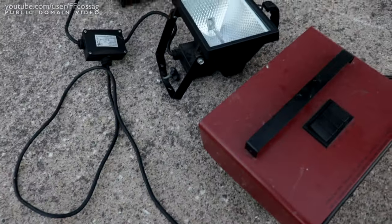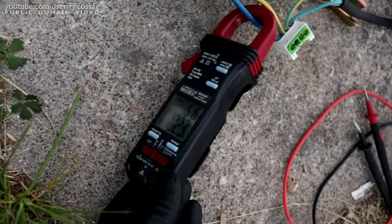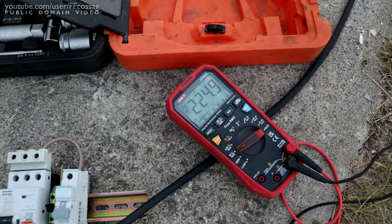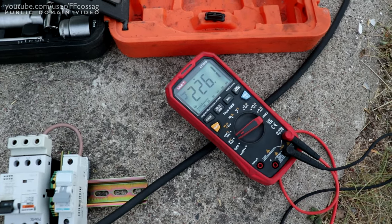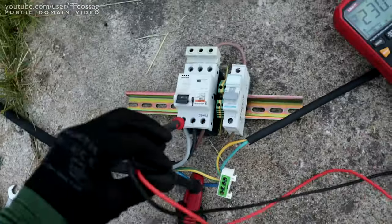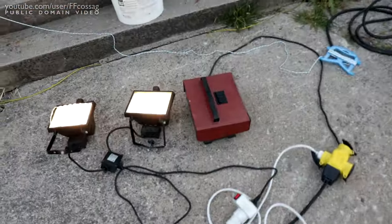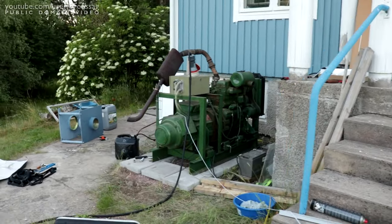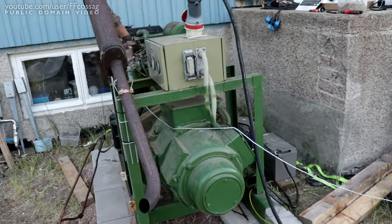Let's go all the way — lights and 2000 watts, uneven loading. We now have over 10A of load. Loaded phase: 225V. Unloaded phase: 226V. Third phase: 231V. So it does get a little bit uneven, but for a 10A uneven load, that's nothing. That transient response is chef's kiss. Granted you would expect that from an absolutely giant generator like this, but it's old, it could be wonky — I'm super happy with that. I think this thing is going to perform excellently.